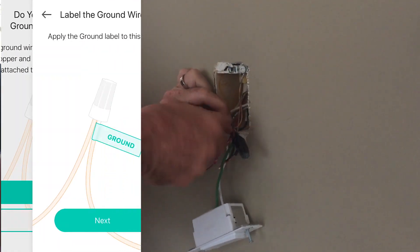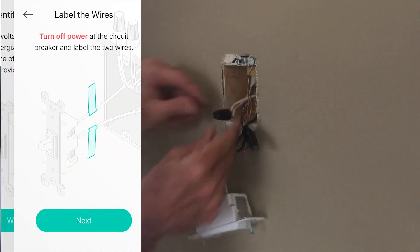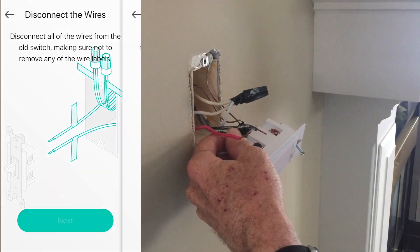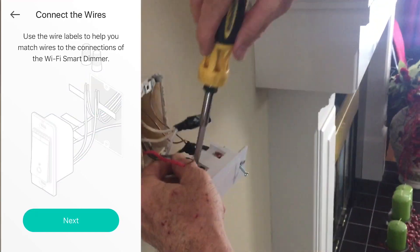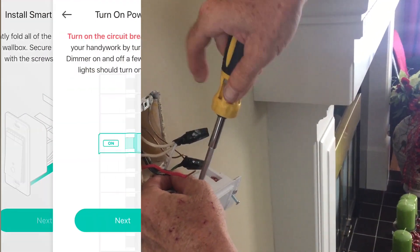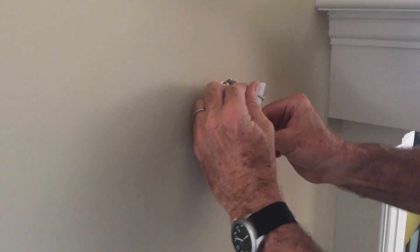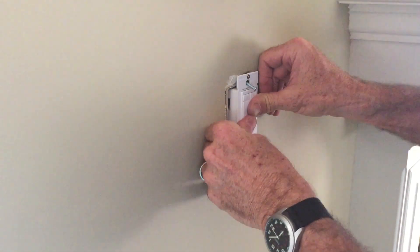The main thing to remember is to flip your circuit breaker off before you start, so you're not playing with live wires. If you're not comfortable working around wiring, you can always call an expert, including Geek Squad. Once you've removed the faceplate and unscrewed the existing switch, you can hook up the new one. Make sure your junction box has a neutral wire — without it, you might get power to the switch and set it up in Kasa, but the lights won't power on. This also applies if you install it on non-single-pole devices or fixtures powered by two switches — neither switch will power the lights.